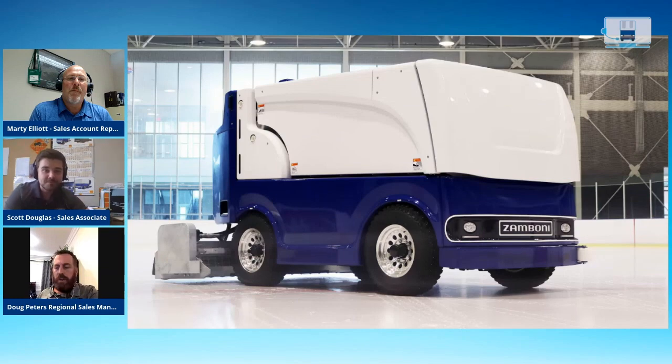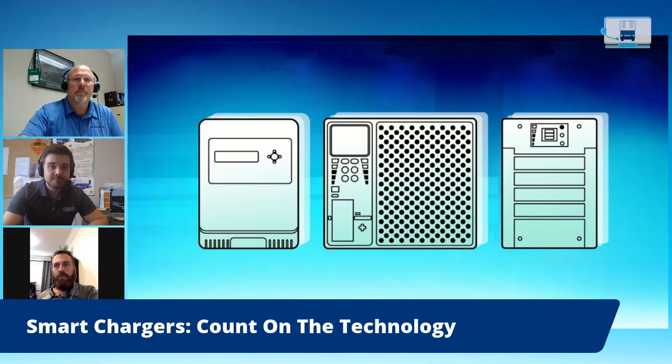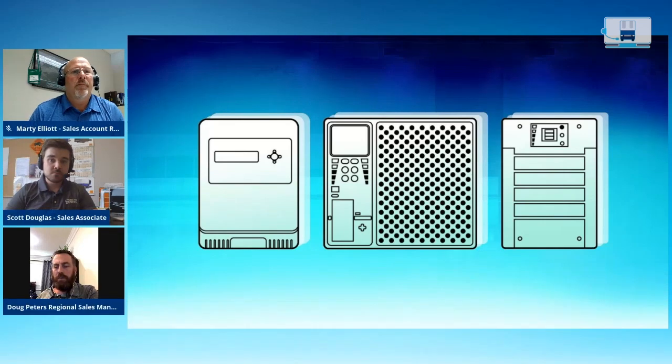Thanks a lot, Scott. Appreciate that. Over the years, we've used a variety of chargers for the 552. We started out with a Life Plus charger, which was a high-frequency charger. At the onset, in some cases it didn't provide us with the durability that we wanted, so we switched to a ferroresonant charger, which was much more indestructible, but unfortunately with it came size. It was a great big charger, approximately a 36-inch cube that weighed about 350 pounds.